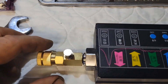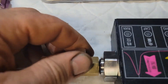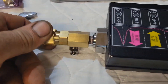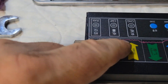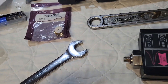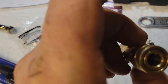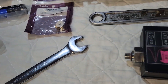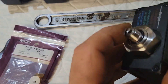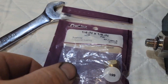Make sure if you do this — make sure you hold down on this nut. This is the transducer; there's a nipple on it under this. You don't want to unscrew this part — you want to take this piece off. And then it's straight through. So now that's where this piece is going to go on. It's an eighth-inch thread, so we're going to turn that into a quarter-inch thread with this adapter.